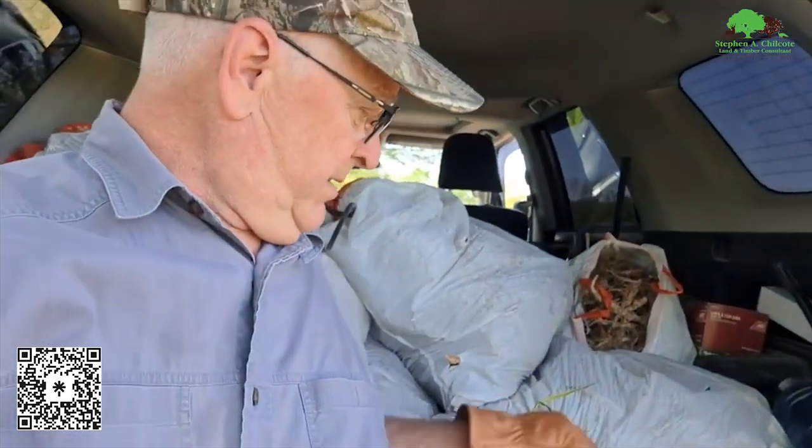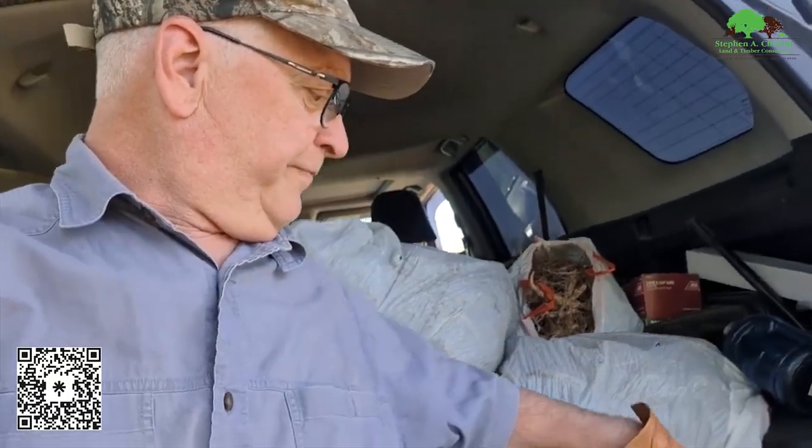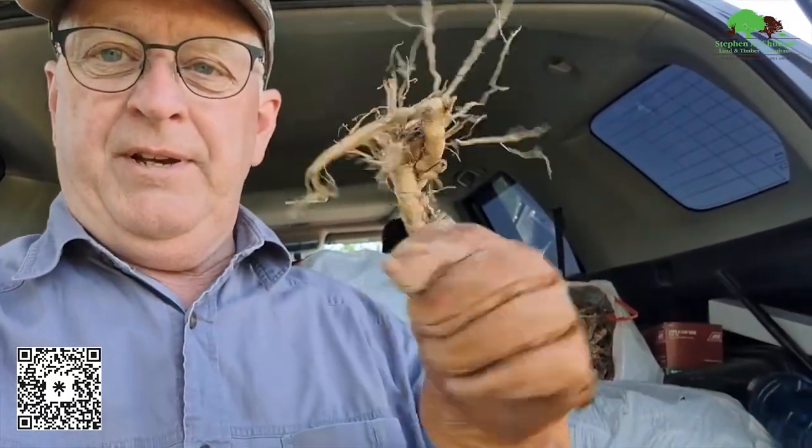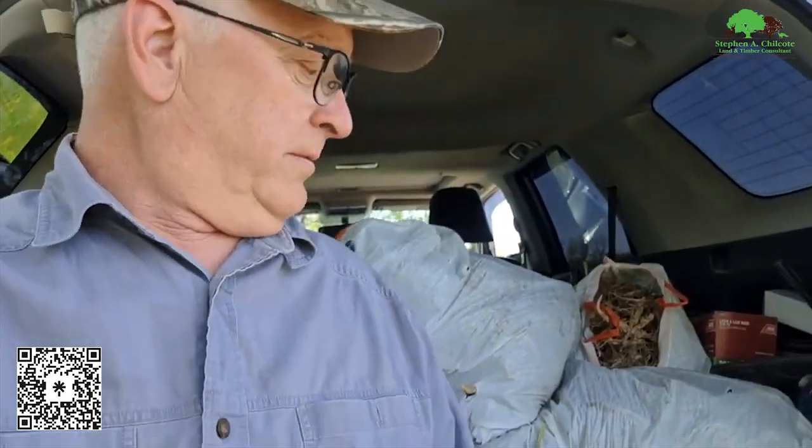That thing just doesn't quite get down. There are so many stones buried in the field that it's not making a good furrow. Some of the roots are too wide — the planter is made for little pine seedlings or some kind of small seedlings. The ones that are smaller go in fine, but the bigger ones don't go through the machine. So we're going to modify the machine a little bit and see if we can get it to work better.